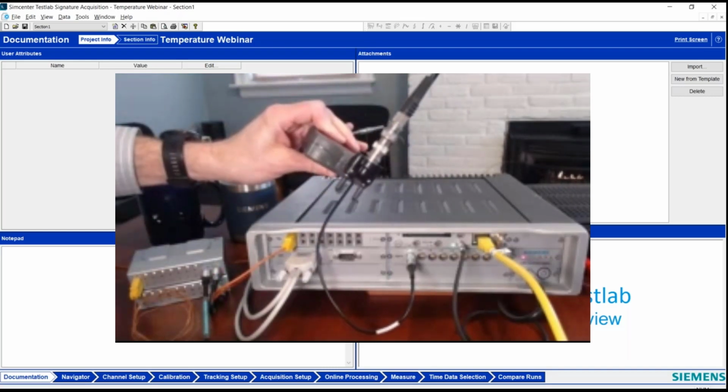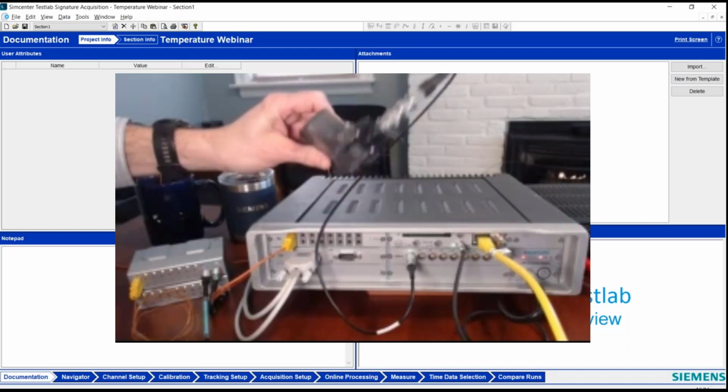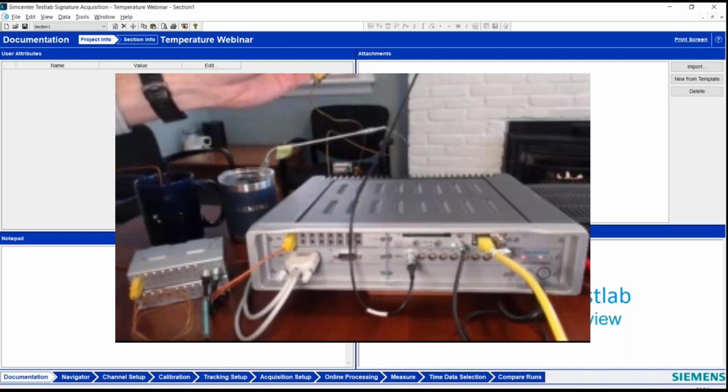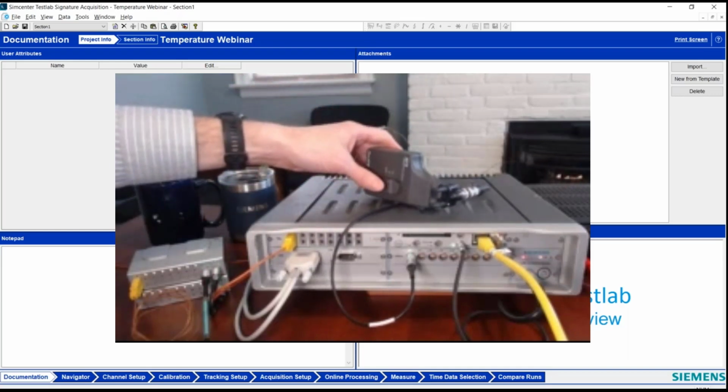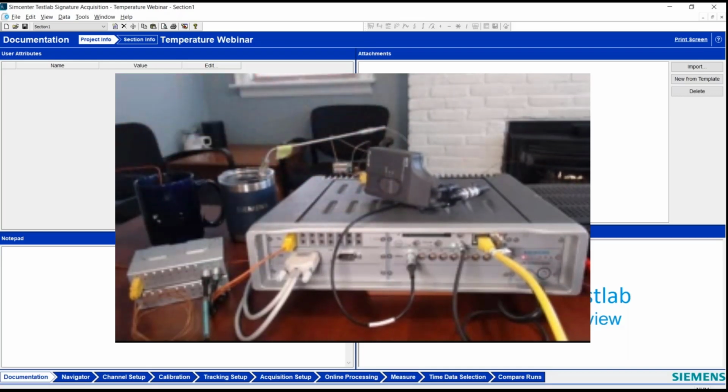And then I take that output that's on those banana plugs, use a little adapter, and plug it into a BNC cable. It goes directly in the front end there. These things are quite economical, and if you only needed a few channels of temperature, it also can be a very nice way to get that when needed.